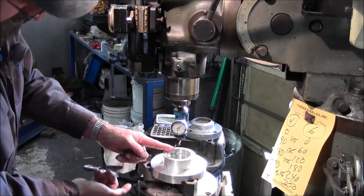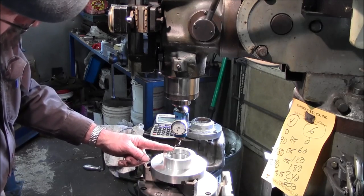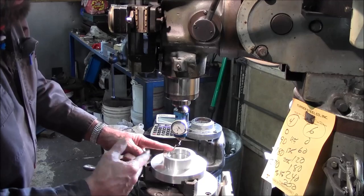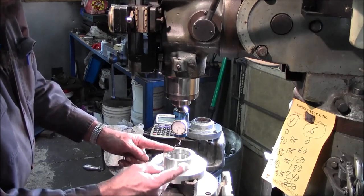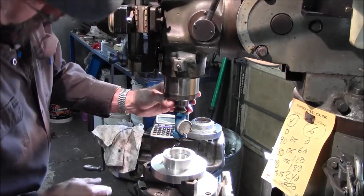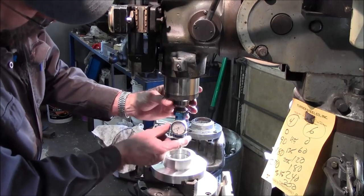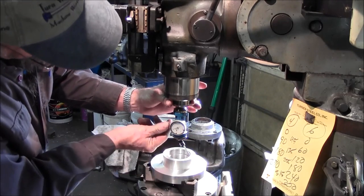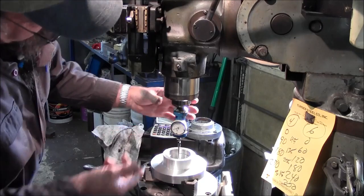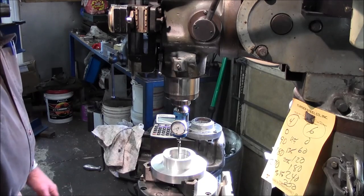Use that same motion with a 6-inch arm, because there's other tip contacts that go way out there, whether it be the same increment or not. All right, but it may be how the barrel moves this way, it might be, but the contact tip is not moving an exact dimension, just like the finger on the end of the 1-inch indicator. All right, and when you put this in neutral, you can really get down to where you're four-pointing it, and you can go in and out or side to side. And then just rotate this, and you can actually see that you would be on that side or this side. You would be at that back side or towards you. Anyway, that's how the coaxial indicator works, and I've got this dialed in, ready to go now.